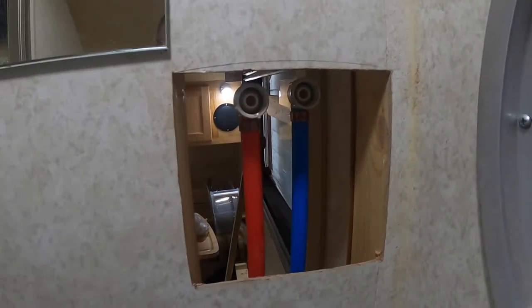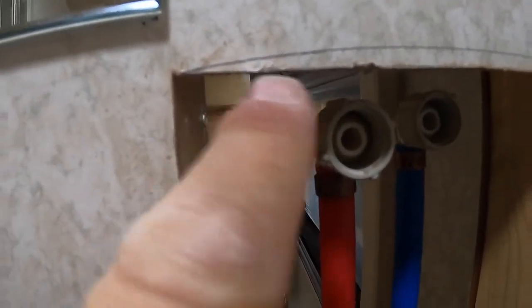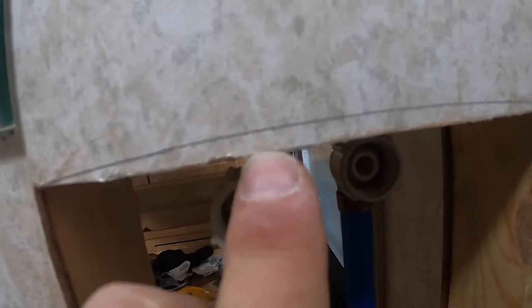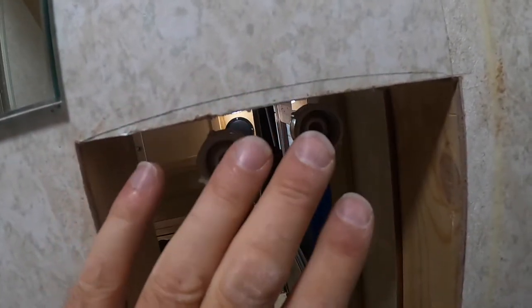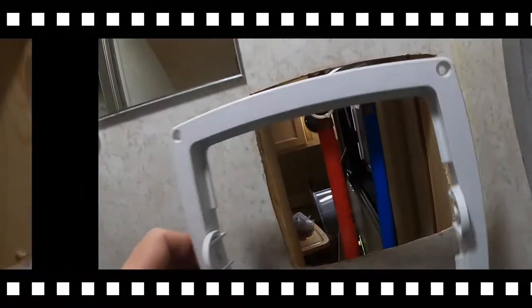Here's a demonstration of what I'm doing. If you look here, this bezel is arched — it goes up and down like that. So even though I cut a square hole, can you see here how I've traced a line at the actual size? Now I'm going to carefully cut that, and I need to do that to the bottom and the sides also. I get a general-size hole and then start trimming it to exactly fit. We'll go ahead and do that to all four sides.